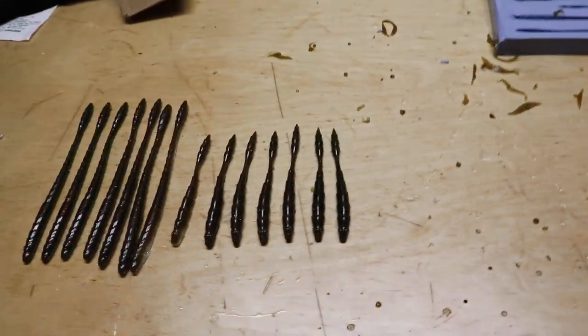We're going to take these to the water and fish with them. This is a super simple project — there's really nothing to it. The main thing to be careful about: number one, safety first. Wear all the protective gear you need when messing with hot plastic — wear your mask, wear your gloves. To melt this plastic you need to get it up to about 350°F to pour it; it takes around 300°F to actually melt it. This stuff I got off Amazon for like 30 bucks. That's all this took — 30 bucks and a bunch of used soft plastics. If you try to sell these baits, you've got legal problems, but everything I did you can get at any store — you can go to Hobby Lobby or Michaels and get this silicone rubber.